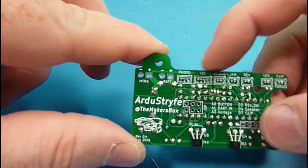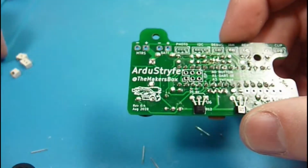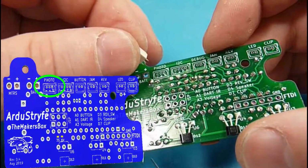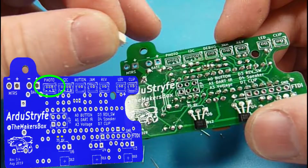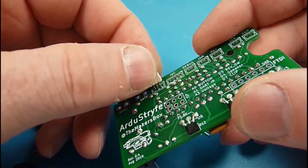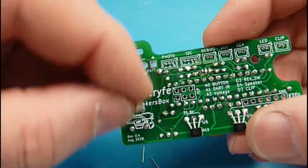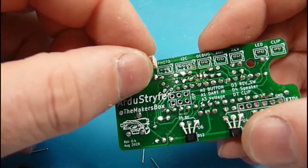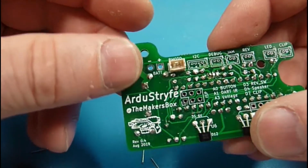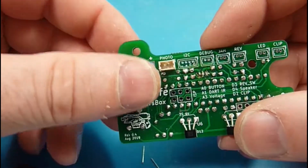So there's a number of connectors across the top where we're going to bring in our inputs and our outputs. I guess we'll work our way left to right here. So the photo cell is in the front end where we've got the infrared emitter and detector pair. We end up combining a couple of signals so we get only 3 lines. These do have an orientation. You see they're kind of offset inside, and they're polarized connectors, so they have to sit correctly or life's not going to be good. So we want them to sit right in their footprint there.